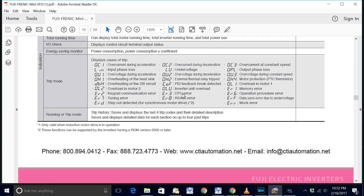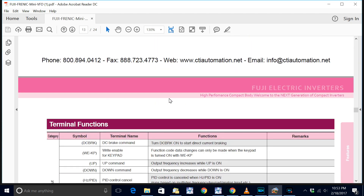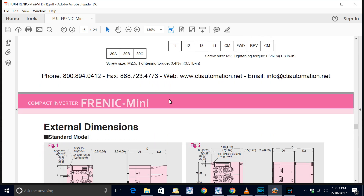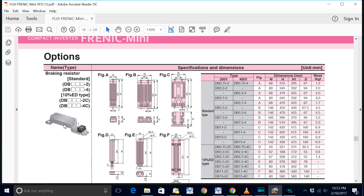When I saw this resistor on eBay, I figured I'd go another way. I love this little quick reference guide — it's got everything you need without going through the thick manual. Here's the peripherals/options section — this is the exact resistor I've got. It gives you the dimensions. If you're running a 3 horsepower VFD, the resistor needs to be rated for 40 ohms and about 1,000 watts. When I got this in, it ohmed out at 40.3, so it's well within spec.